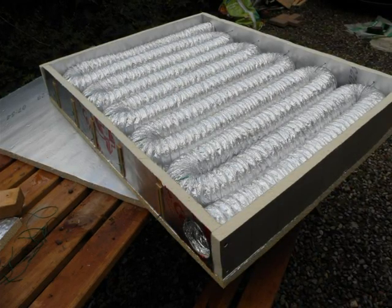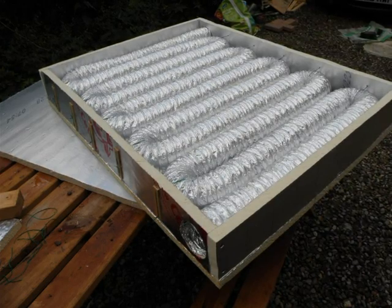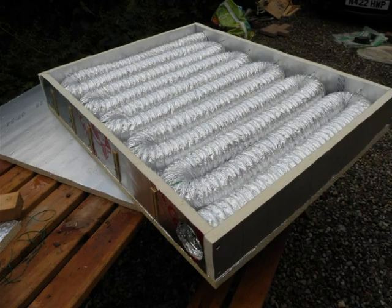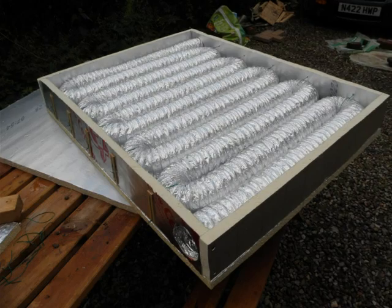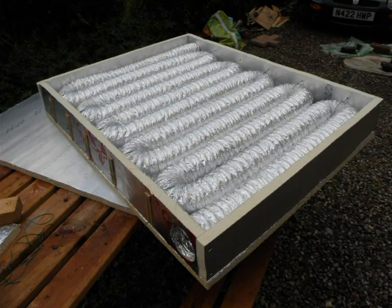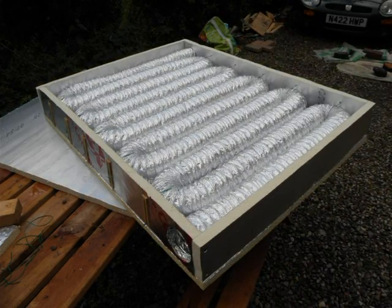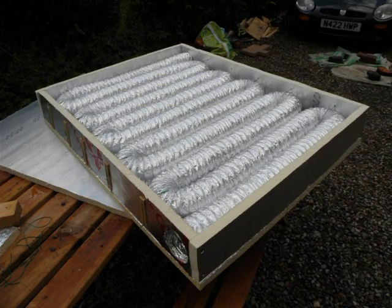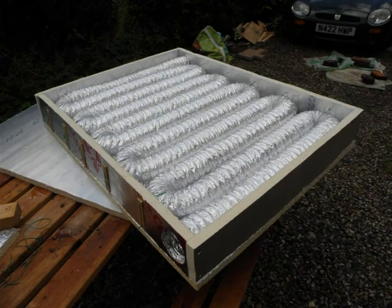This is a 10 meter coil. It's aluminum foil with a sort of reinforced wire stiffening throughout, and it's also plastic coated on the inside. It also has a surface which is angular and crinkling. This has two advantages: one in that it actually absorbs more heat — it has more surface area to absorb more heat from the sun — and also it allows the airflow through to become more turbulent, which allows the air to pick up more heat.